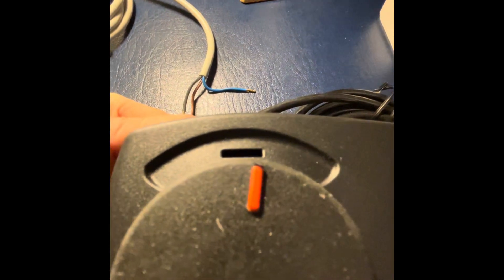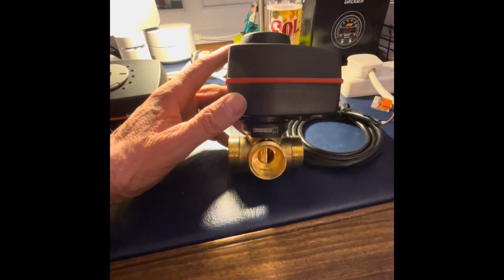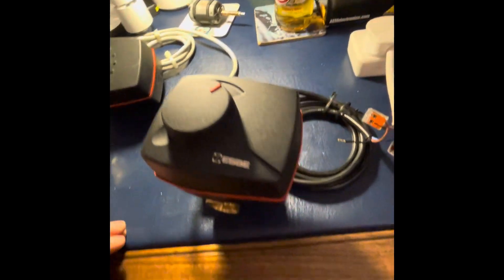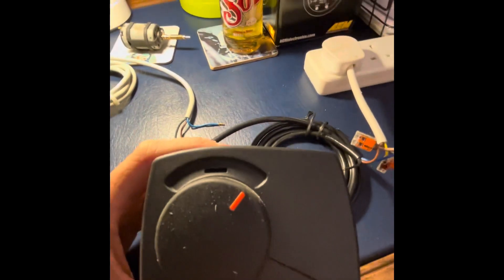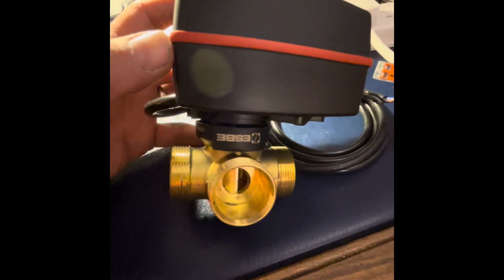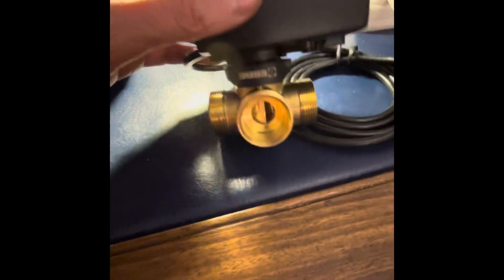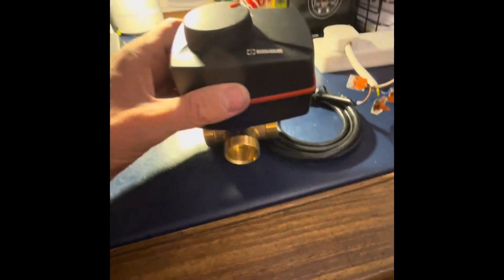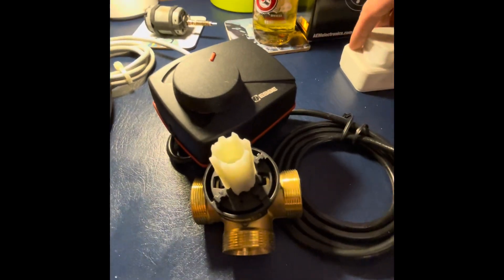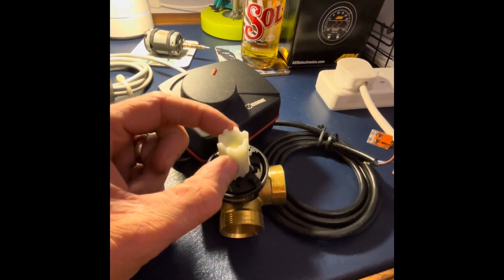If I hold this steady long enough it's going to move to a closed position. This is theoretically a diverter and when live has power it will move to the closed position. The valve's moved over from the mid position - but that port is still open and that's open. It hasn't worked, it hasn't done what we wanted. If you lift the head up, it's not connected properly - that's a quite common issue. The head hasn't been put on correctly and it doesn't actually move the valve, so check that.